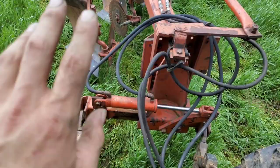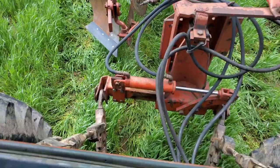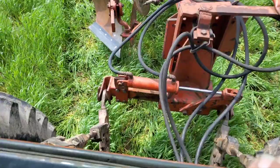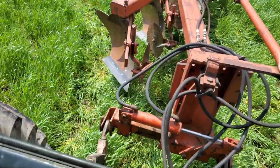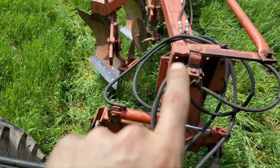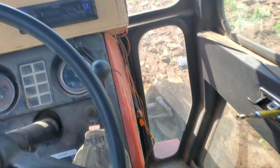I should have measured stuff and figured out where the center of the hook is, but basically what I'm going to do is hit this without any weights and get it to where the tractor is pulling straight — not trying to pull me towards the furrow. I'll kind of mark it from there and go with the feel of the tractor. You want it set to where the tractor pulls straight and you're not fighting left and right. It really helps to have a book — look in your plow manual to find the center line.